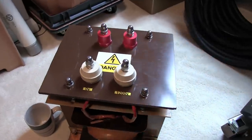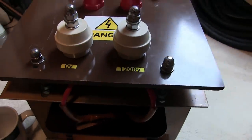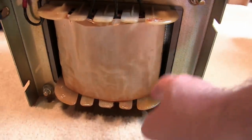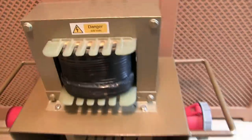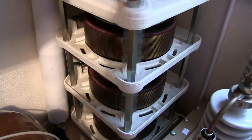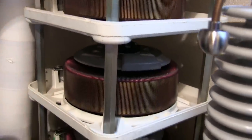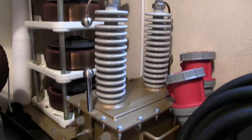You've probably got that — the tasty transformer that Alex brought down has been restored like new. It's got brand new terminals on it and the bobbin end plate has been fully repaired, no trouble at all. Most of these transformers have bobbin ends that can be a bit vulnerable, so one should take care — don't pick a transformer up by its bobbin end, otherwise it's likely to snap. These triple-stack variable transformers can be quite costly to get hold of. You can run it three phase or single phase with balancing chokes between the three.